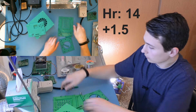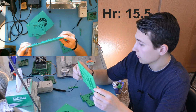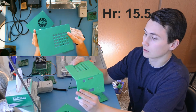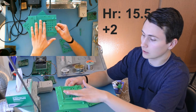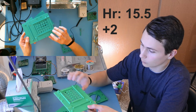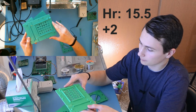There's another component, the bottom plate, which mates with the power board and has holes that the LEDs can pass through, as well as some screw points to combine these two plates. There are some PCB supports spread throughout to try and help keep the PCB from flexing under the forces from the heatsink sitting on the board in the middle here.